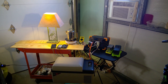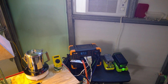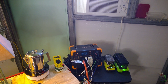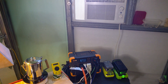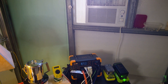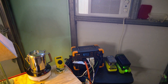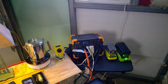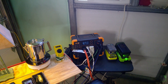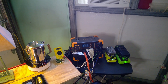Obviously it's not reasonable to expect this unit to power all this stuff all day wide open. Running an air conditioner on a unit this size could be difficult, but if you have a small space to cool and don't turn the thermostat down too cold, it's doable. With 300 to 400 watts of solar panels, it's absolutely doable. Getting through the night is probably not going to happen, but you could run it for two hours at sundown.